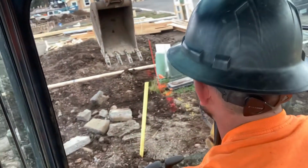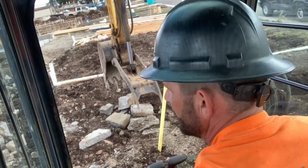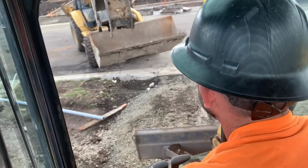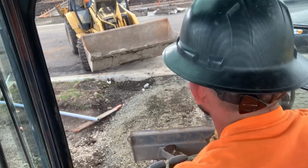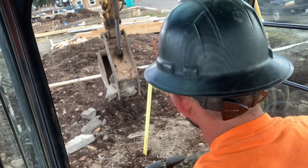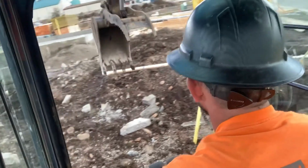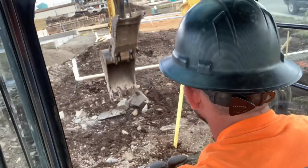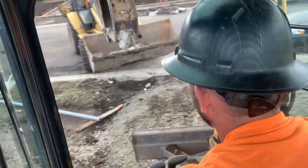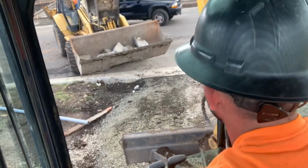So this morning, the 312, I started it, let it warm up for like 20 minutes, and then I shut it off because I was using the skid steer. And I shut it off and went to go turn it back on again to use it, and it wouldn't start. With the batteries, we'll kind of find out. The mechanic just showed up, and the belt is so loose on the alternator. The batteries are good, it's just they're not getting any charge, or enough charge. It is what it is. Got to take it into the shop. Get it on the trailer.